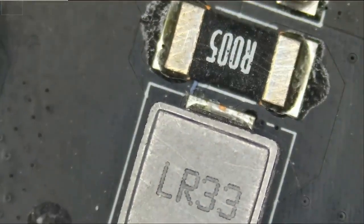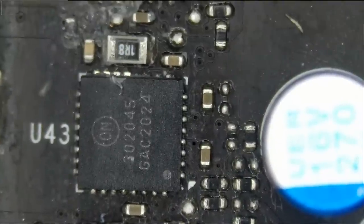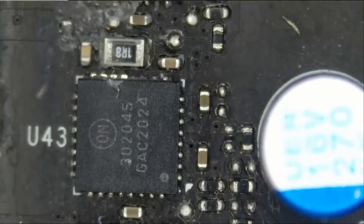Right now, what I'm going to do is inject voltage at our shorted line here, whether it's at the current sense resistor or coil or the 12-volt pin or the fuse. Anywhere I inject voltage is good. And we're gonna monitor the board under a thermal camera and see what gets hot. Hopefully we can pinpoint where the short is coming from. We are dealing with a very thick board, so heat may be very minimal. We have to keep our eyes open when looking at the thermal camera and try to see what is getting hot on the board, even if it's just a tiny minimal heat.